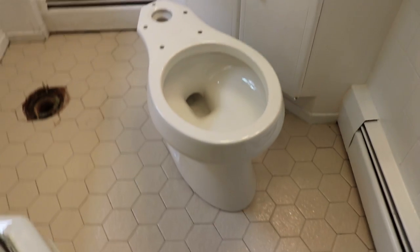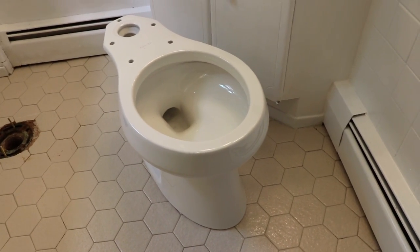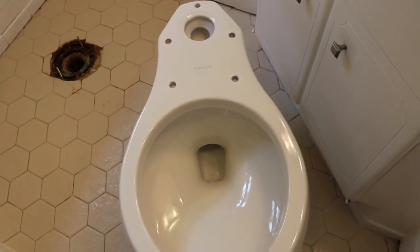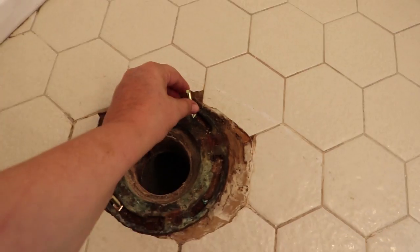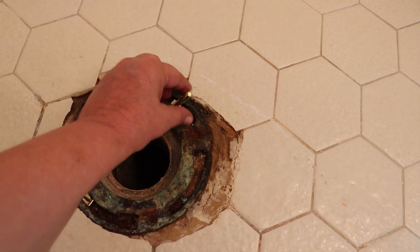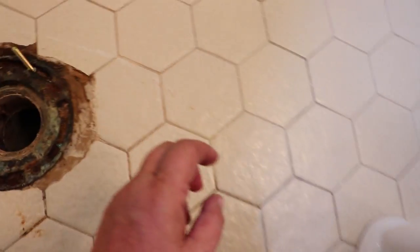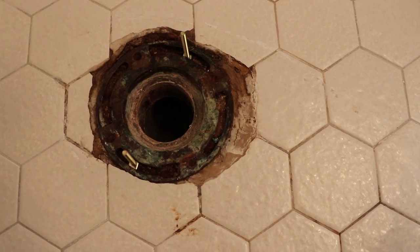Here is the new toilet — a standard toilet bowl, Kohler color, pure white instead of the biscuit/cream color of the old one. What I like about it is that the spout at the bottom is really, really huge, which tells me it's probably going to flush properly. Before I install the whole thing I need to coat the bottom. These are the new bolts that you install in the flange — they're kind of square. You place them like this, turn them, and put them in here, parallel to one another, because they fit on either side to affix the toilet to the floor.